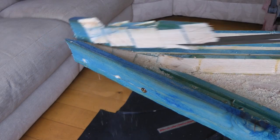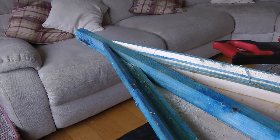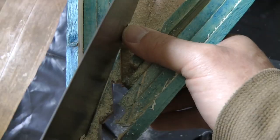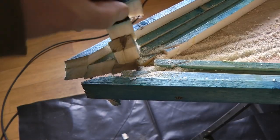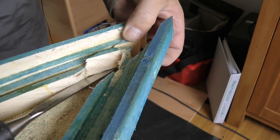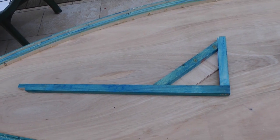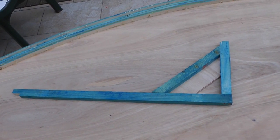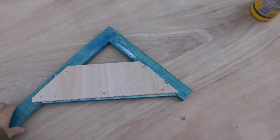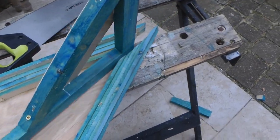Having got five layers there now, I'm cutting the front and the back, just knocking out the little piece in the center so that a piece of tile batten will fit in there snugly. Doing the same at the other end, and then I've made up this triangular piece — triangles are always strong shapes — and I put a ply gusset on it to make it even stronger.